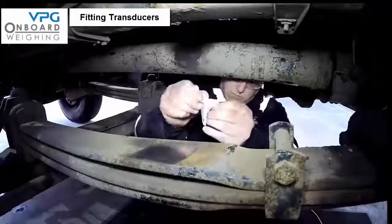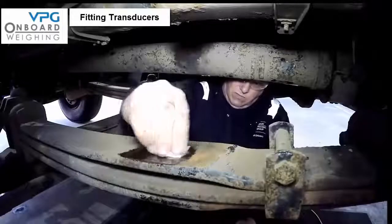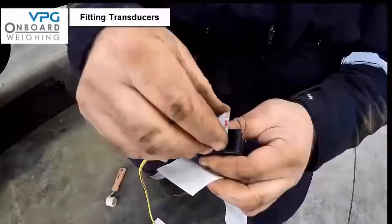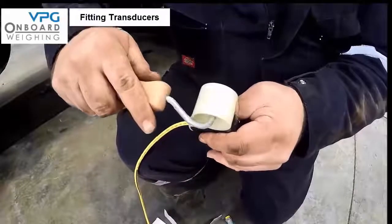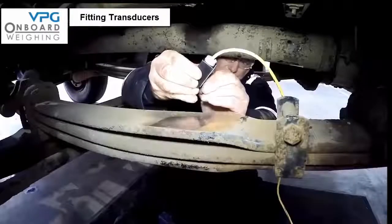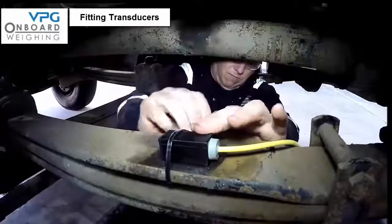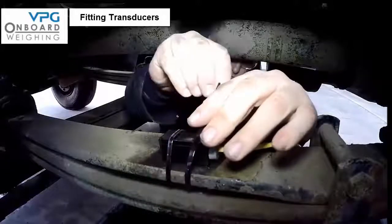Make sure the site is totally dry and clean down to bare metal. Then clean the prepared area with the VHB surface cleaner, allowing the solvent to evaporate to leave a clean dry surface on the spring. Now clean the transducer with the VHB surface cleaner and apply one of the VHB tape strips to the transducer, applying pressure to the tape using a roller. Remember the temperature of the surfaces should be above 60 degrees Fahrenheit — if not, warm the spring with a hot air gun prior to bonding. Take the protective strip off the VHB tape, position the transducer in its location, and use the clamp to apply pressure to the assembly for 5 minutes. Then fit cable ties to provide mechanical support during the bonding time, which can take up to 72 hours. The cable ties can be left in place indefinitely.